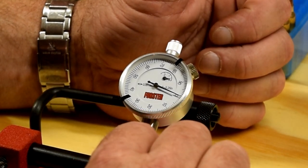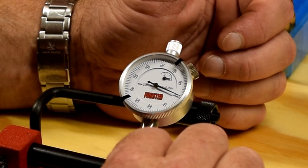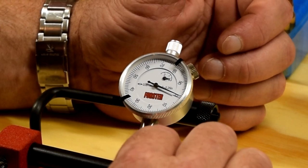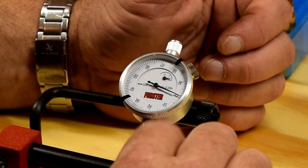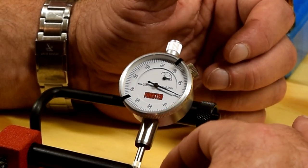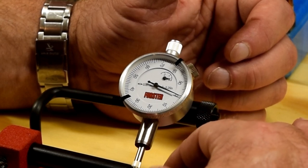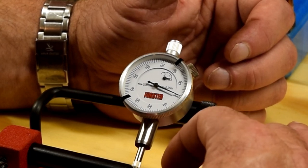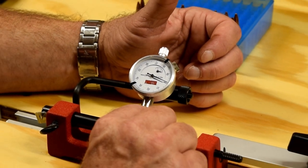And I don't know if you can see it in the video, but we'll rotate this. It's loaded up. That one appears to be pretty good. It's going below zero on one section — maybe a quarter of a thousandth. So let's check another cartridge.